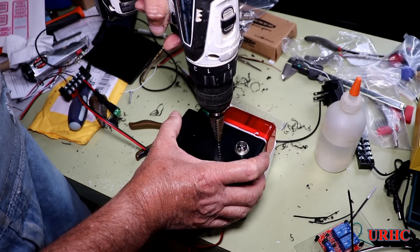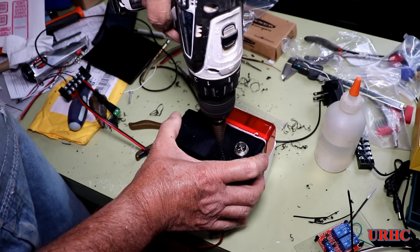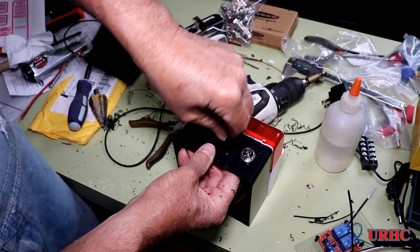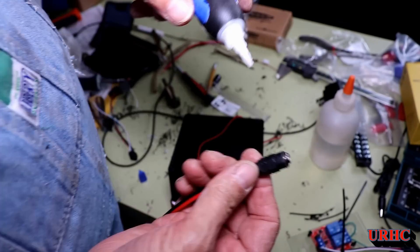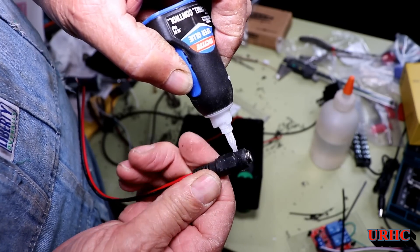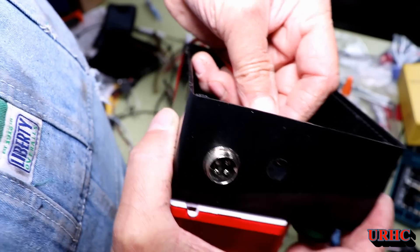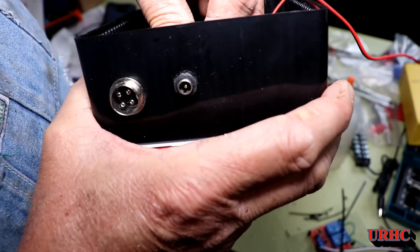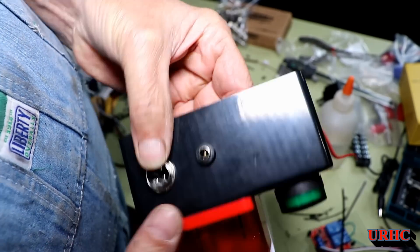I'm going to put a 12-volt power jack in — just an old 12-volt LED plug I had left over. Everyone's application would be different, so I'm just giving you an idea here. To mount the 12-volt plug-in, I drilled a clearance hole for it, then put some super glue gel on it and stuck it through the hole. Since I didn't have a panel mount, it actually turned into one in two seconds — easy way to do that.